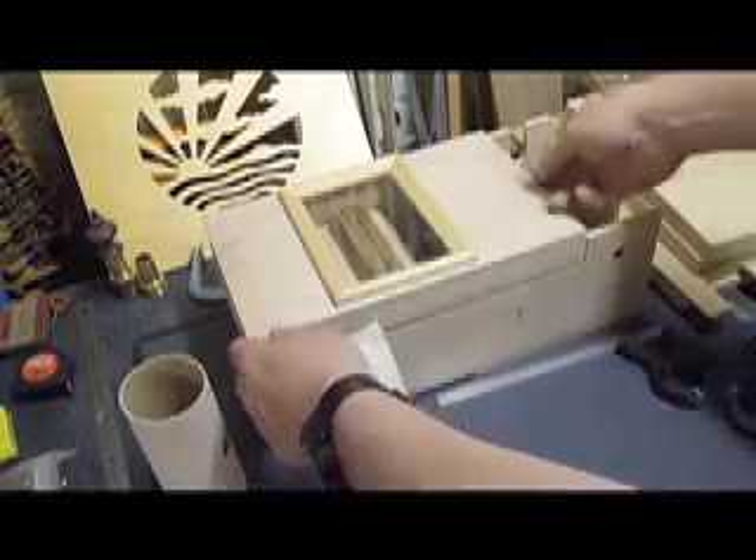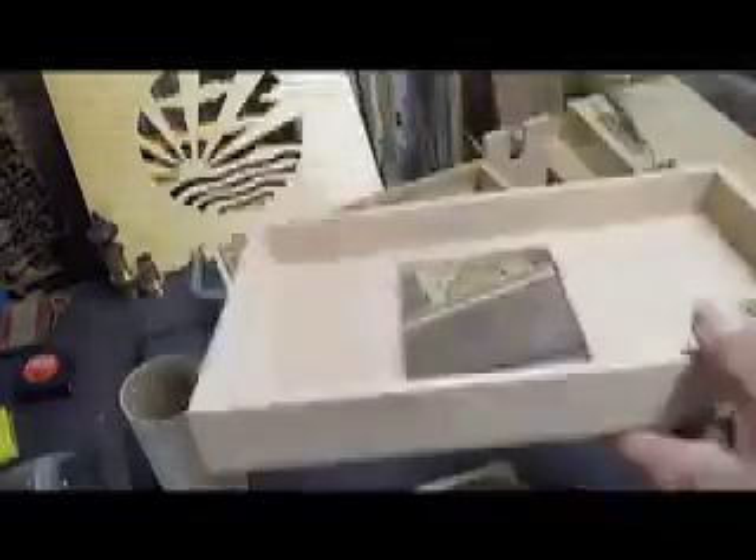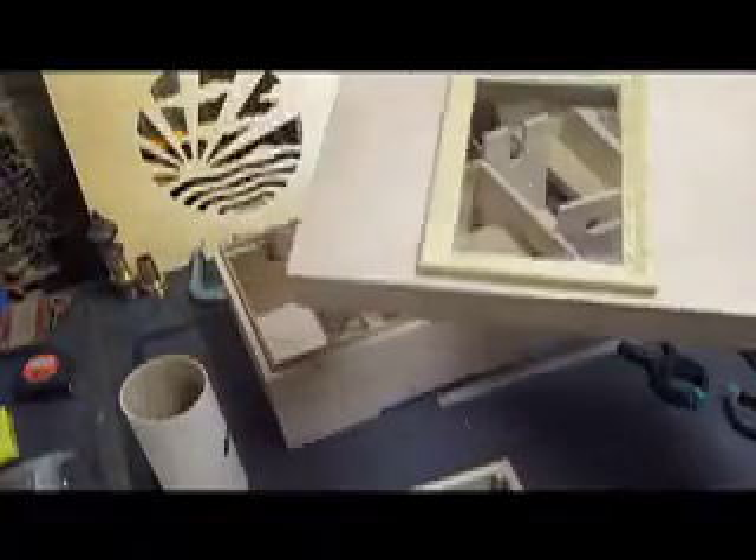I've finished the lid of the pressure box, in which I have put plastic — not glass, which would have been nicer, but I was worried that glass if it got broken would do serious damage to the interior mechanism. So I've put plastic there with a bit of picture framing around it, glued in simply with a thick coating of crystal araldite glue, the same inside and the same outside. I think that must be a pretty airtight seal. So the lid is finished.